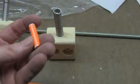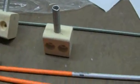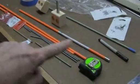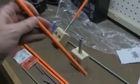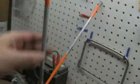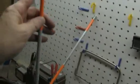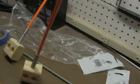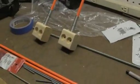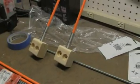You just drill a hole and then slide it in — it fits just real nice. Then we'll take this little piece here, which is the same length as the depth of this top hole, and we'll just drop this in. Then we'll take the rod — this little rod here is around 20 inches long and this is my design, so I can give you these dimensions. We'll slide this in here, and that's it, that's all you got to do. Then you take some ties and run your wire up the pole and put some ties, or you could use electrical tape or Velcro, anything to keep that wire hung onto it. It'll bend over the way you want when the wires get pulled over. You need to make two of those. They aren't painted yet but they will be. We'll clamp them onto the gantry, drill the holes, and it'll be real quick and easy. It works really well.